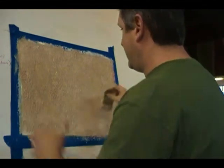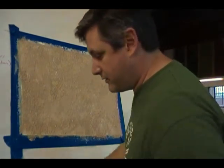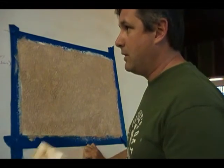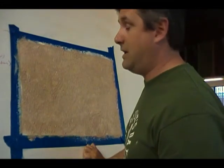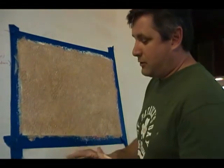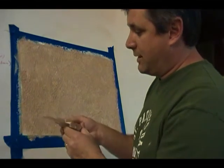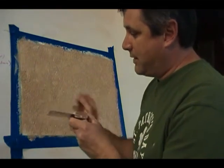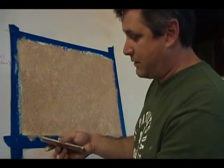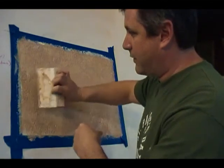I've got about a two-foot square area completed, and I'm going to leave this set for a few minutes. Depending on temperature and humidity, it can take anywhere from two minutes to 15 minutes to be ready to take the distender tool across it. The distender tool is just a little plastic blade set into a piece of wood. These have a little cup to them — they bow up and they have a cup. The biggest thing to remember is: belly down, cup up. If you put the cup down, these two points are going to drag and leave little railroad tracks.